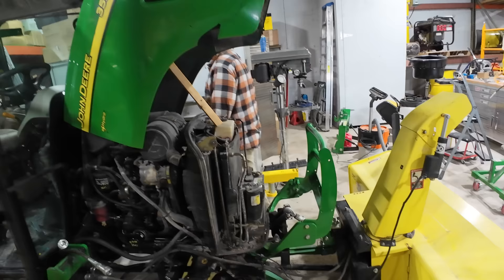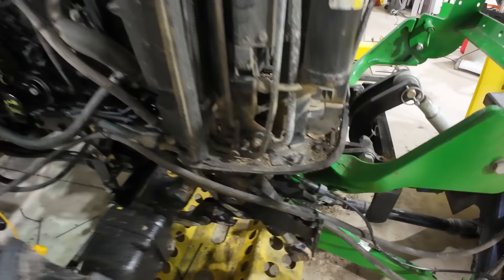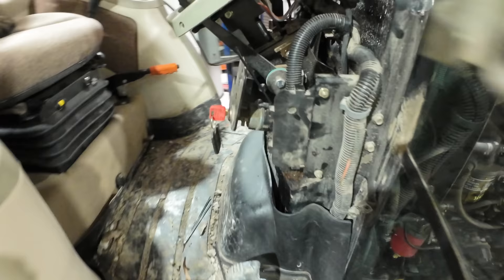You've got that wired and you've got a nice little plug right here, and you've got that wire ran. I can't even see the wire — that's what's so cool about it. It's tucked up in there quite nicely. We had to punch a hole through the firewall, or whatever you want to call it, with a little rubber grommet on it and some RTV just to kind of hold it in there.